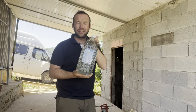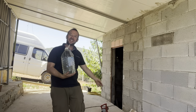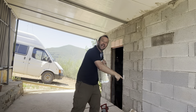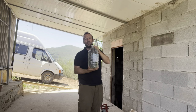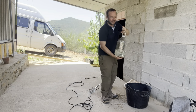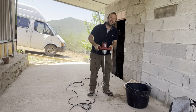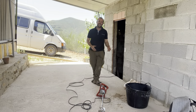I'm going to use this five litre bottle. We need to put the Cola Classic, which is a tile adhesive, into the bucket. It needs 4.5 litres — so a little bit less than this full bottle. I'll leave that much there and add the rest later. This mixer is going to do a fantastic job of churning up that Cemento Cola Classic.